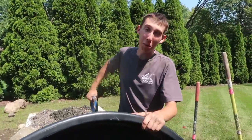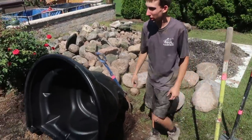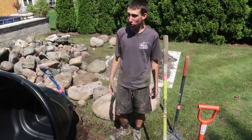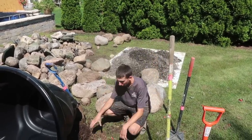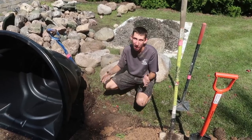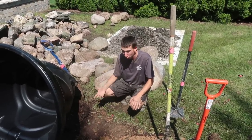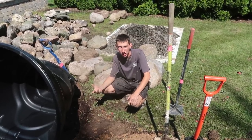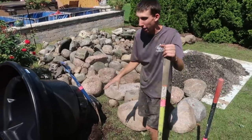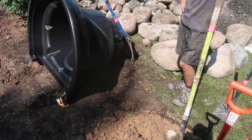What are you working on, Jack? Installing the 6000 bio falls — nice, two-inch or three-inch? Right now we're a little behind schedule unfortunately. We're excavating the pond out and originally we were supposed to have the bio falls installed first, but things happened. I'm cutting out where the bio falls is going to sit — I set it to the height I wanted and set it back behind the next pond so I get a nice stream with some twists and turns. The most important part is leveling it off: no organic matter under the base of the bio falls because it'll allow it to settle backwards or sideways and shift in the future. Always compact with no grass, tree roots, or plant matter that might decompose and allow settling.